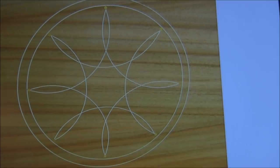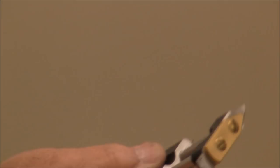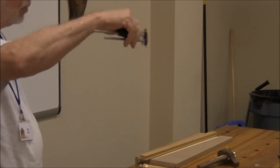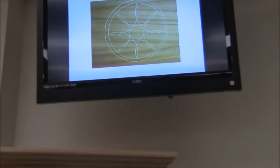On some antique furniture that probably now sells in the millions, you have these little dots all over the pieces and you wonder what that was for — that's where they had the trammel point. So I use a piece of plastic and double-stick it. That pattern up there you'll find on a lot of Pennsylvania spice boxes — all done with this tool. I made a mistake on this one — I'm going to point it out to you. I don't know if you can see the little yellow berries at the end of each one. When you do this kind of work, you want contrast — you want it to jump out at you. I should have used any color but yellow. Black would have been good.